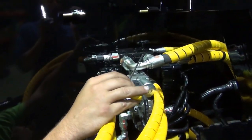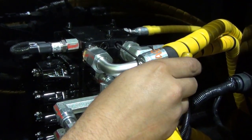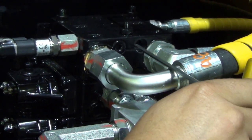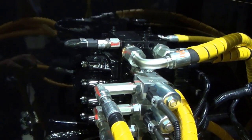Now we're going to adjust the pressures on our main valve up front here. What he's doing right now is adjusting our main relief for the main valve. You want that to a snug bottom — you don't want to bear down on it, just a snug bottom. That's going to give our relief there, max pressure, which is 3,000 PSI.